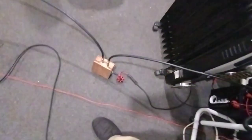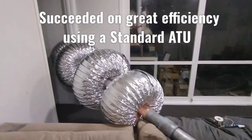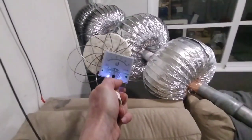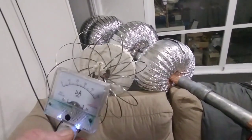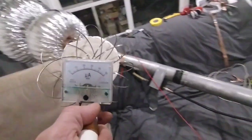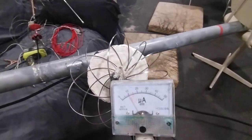That's no longer in use — that was a bias T. I'm no longer doing magnetic tuning. This is the choke, it's a couple of radials, and there's the hot side of the antenna. The field strength meter — even the lights in here are for when it's being overdriven. It's a 50 micro-amp meter with LEDs across it, and you can see it's very hot. Now watch as I come past the choke — down the coax — and she dies off.